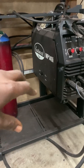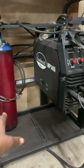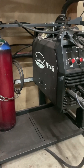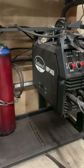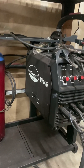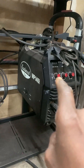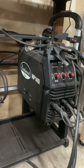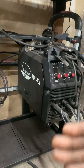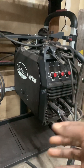You have three leads of 10-gauge THHN stranded wire coming from your breaker and your neutral bus, which is on one side. This is not telling you guys to go do this — I'm just telling you what I did. You have a neutral bus and a ground bus in the box. It's just three wires basically running to a 20-amp outlet. The 20-amp outlets are what you may see in your kitchen within six feet of your sink, or your bathroom within six feet of the sink or shower. It's part of the electrical code. It's called GFCI because my outlet's outside, and it has to have its own breaker circuitry with two buttons — test and reset.